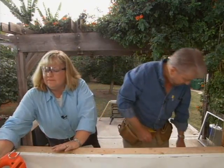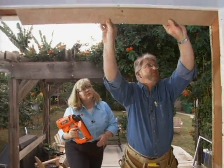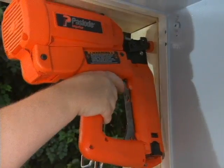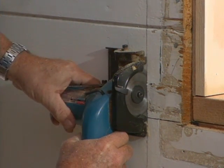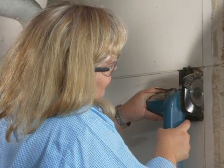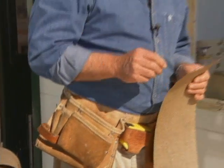I give Jenny a smaller nail gun and we start putting pieces on the top. This is a piece of shim — actually just a spacer. Jenny nails the shim in place, then we add a trim piece. Now we're ready to begin cutting away the siding. This small handheld cordless power saw is lightweight and easy to handle. Jenny finishes the cut and the siding is easily removed.